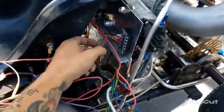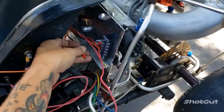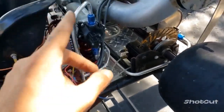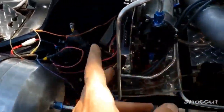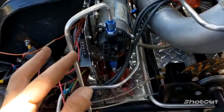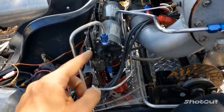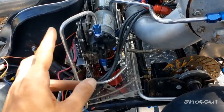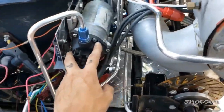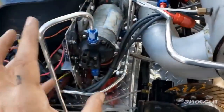When I got to the fuel pump, I noticed I was getting 12 volts through my ground — it shorted out. Something's up with the fuel pump. I tried isolating it, just getting 12 volts straight to the pump, grounded it — nothing. A lot of sparks and anger. Fortunately, the old oil pump is identical to the fuel pump. I'm pretty sure the diaphragm seal was no good in the old pump — anytime it would build oil pressure, it was just forcing oil into the casing and leaking out. It was no good.